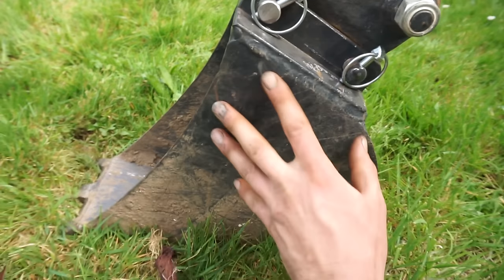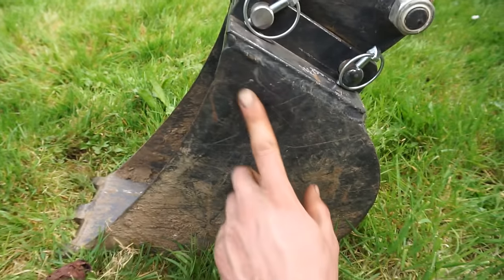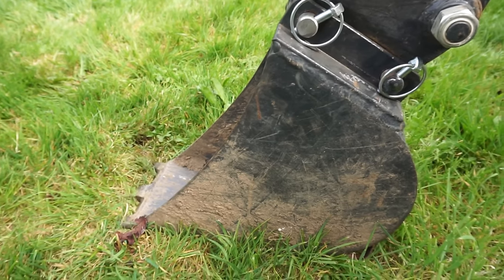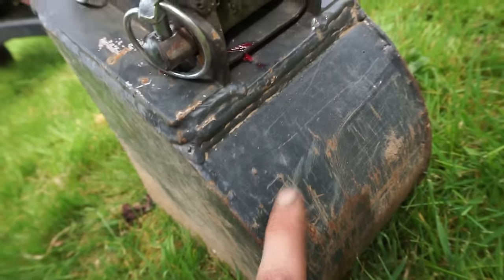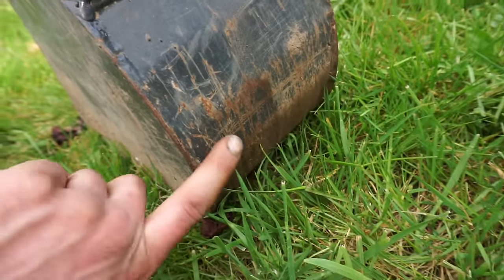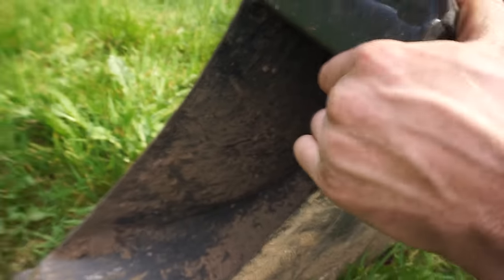And then the last one on these, the bucket, which bizarrely I actually made first out of all of this. I off-cut some metal and then looked at it and thought, oh, that nearly looks like a bucket. So I turned it into a bucket and then thought, oh no, I started making a digger. So a digger ensued. It's just a bit of plate. The actual back part around here is a bit of 150x3 flat, and it's not one continuous bend. He's kinked every 40mm, I think. I just put it in the sheet metal bender and dragged it on round a bit. Then up the top where it ends, I bent it on round and carried it right round the front to brace it so it wouldn't tear away, which seemed to work.